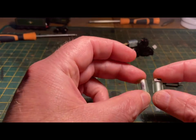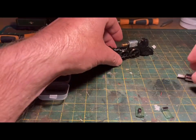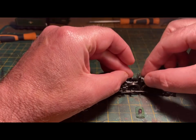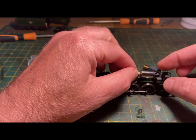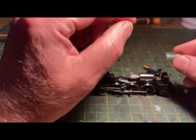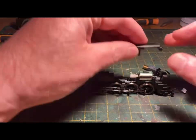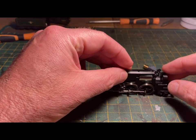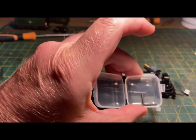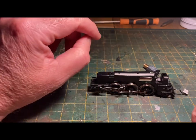There's 'up' and 'down' actually written into the print. These are developments, these are prototypes — this is very much the very first one that's been done, so there will possibly be changes to make. I'm just going to do a dry fit before I unsolder this motor so you can see. We have the one marked 'down' and that is going to locate in there. One of the advantages of this size of motor is that it's actually a perfect fit for the space. The other kit's motor is quite small and needs a lot of packing around it; you also have to glue that to the motor itself. This will fit in here with a little tab towards the back so the existing motor mount will fit on.